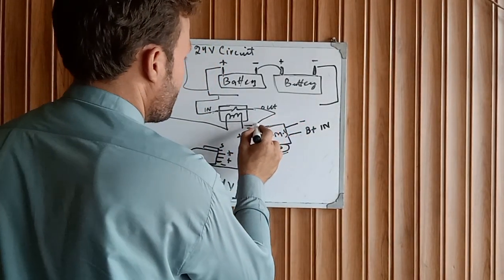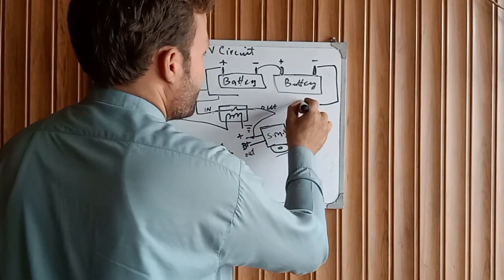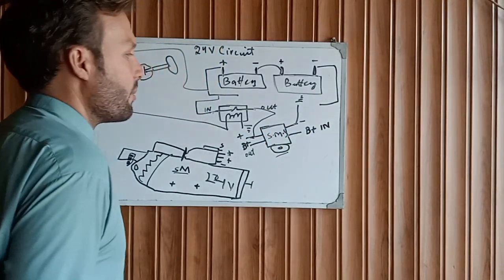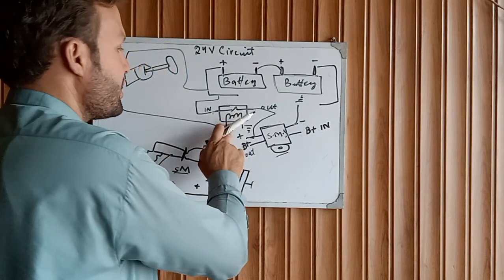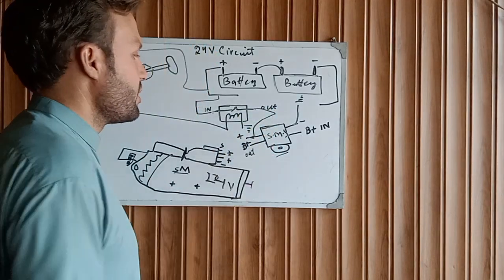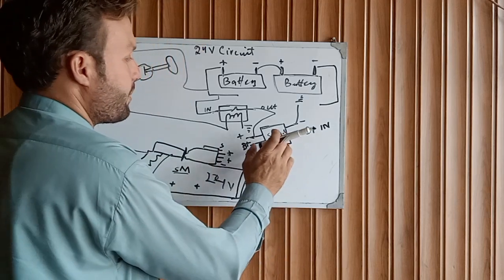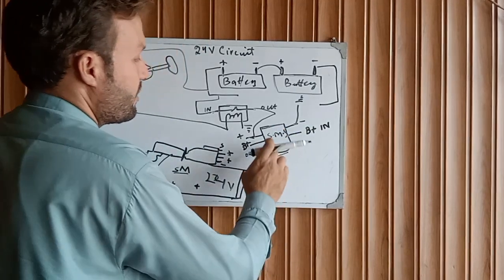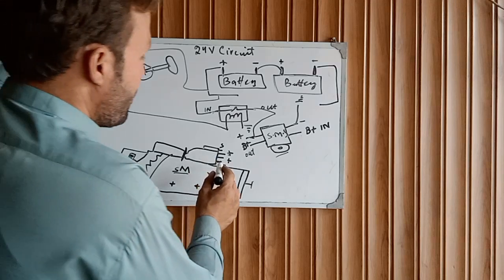This is the magnetic switch — give this positive to the positive terminal, and this is the engine ground. When the relay is energized, it sends the positive signal to the magnetic switch. When the magnetic switch receives the supply, it goes to energized.